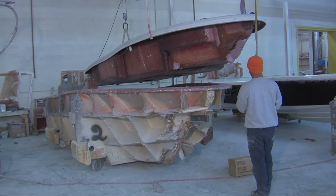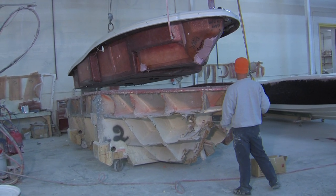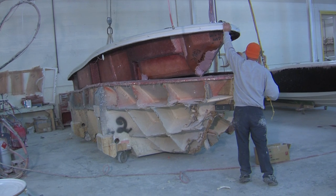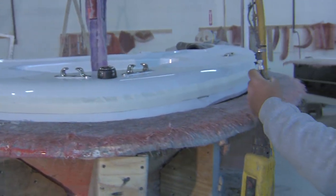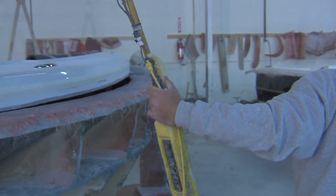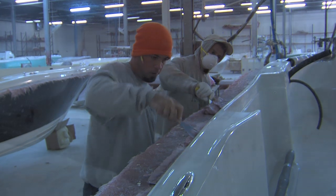At Pioneer they figured out a better way. They cap the deck inside of the hull while it's still in the mold, which is kind of unique — the deck fits inside of the hull and there's a solid putty joint all the way around. So if you were going up against a dock, the boat would separate itself with a shoebox fit, but the way ours is, it pushes itself into each other and does a lot better than the traditional shoebox fit.